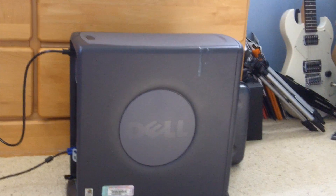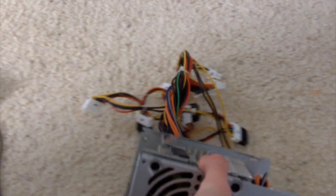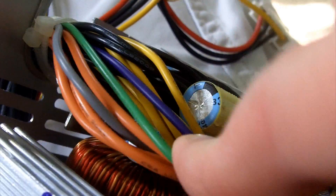I'm going to install Apache right after I finish this video clip. Right next to me we have the dead Dell Dimension power supply. As far as I can tell, nothing looks blown — all the caps look good, none of them have vented or anything. I'm trying not to touch anything because it could still be charged. There are no visible burn marks on the board, so it might be a fuse. I'm going to take my multimeter and test out a couple of fuses with a continuity test, because I don't want to throw out this power supply.